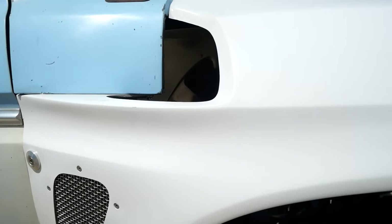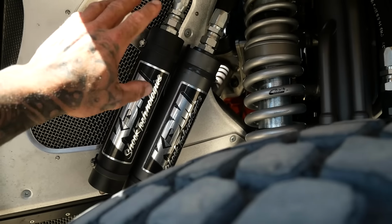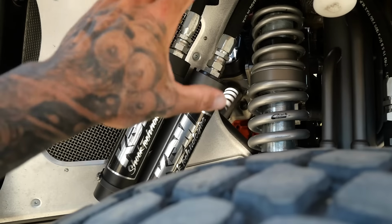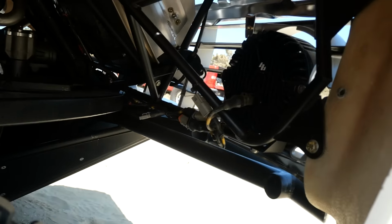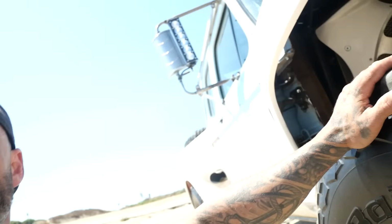And that's what I was getting to, to tie it back in, is the additions on this second version of Ivian. You can see there's some sheet metal additions that match the rear sheet metal treatment. All of this raw stuff is all new enclosure. Getting the reservoirs, getting a win with the reservoirs like that and running parallels, that's all stuff we added when we revised it. The other thing we had to do is redo a ton of all of this stuff. All of the substructure, like the grill mount, the light mount, the radiator mount, no matter what, you can't save it. If you crash, the weight of the truck and the G-forces, you build it out of 2-inch, it's still gonna bend because it's an outer extremity of the car and it's a consumable. Yeah, we don't wanna forget about these fenders.